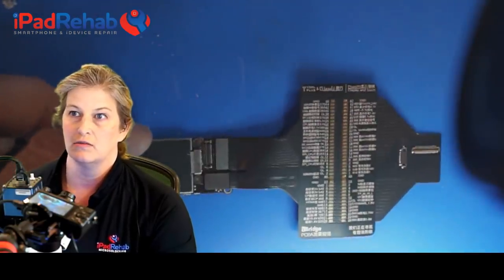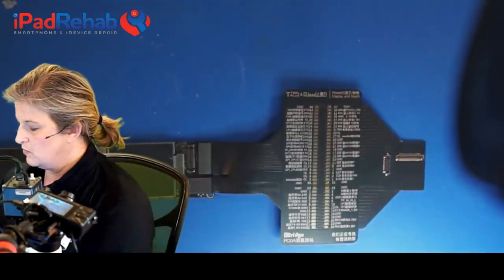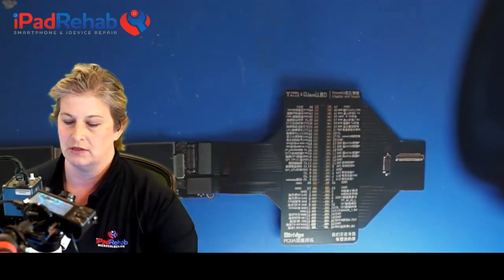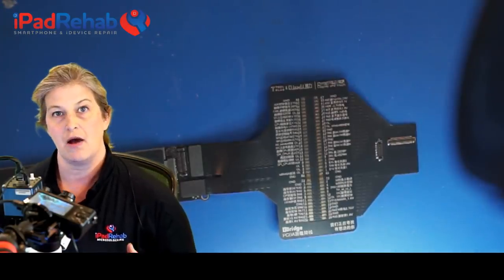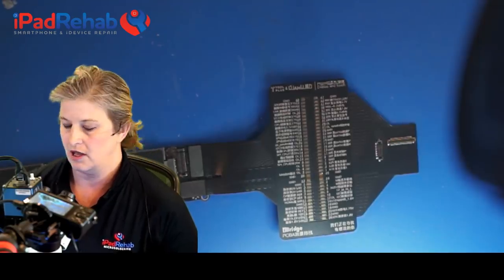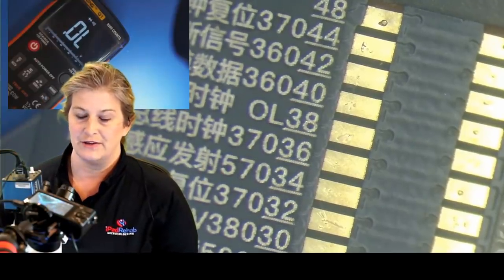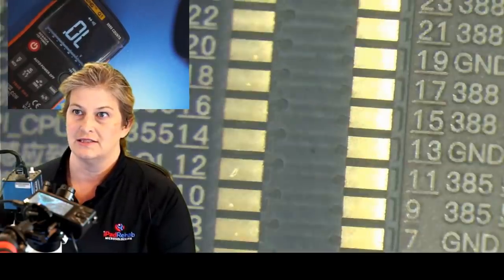All right, so now what we're going to do is take diode mode measurements, which is the way we indirectly infer the overall resistance on the line. Is it short or open on each one of these lines? Some of these lines are going to be resets and enables and power and data in and out. So we're going to see if we have a problem on a line in this connector that we think is important for touch.